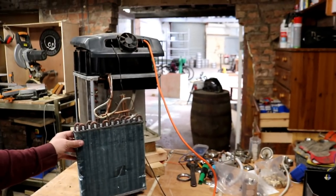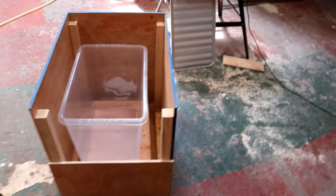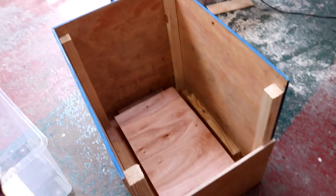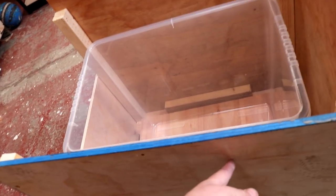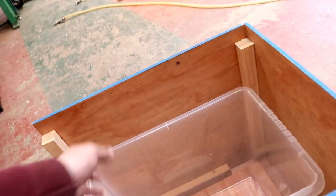This is looking exactly how we want it to look. You can see how we've got it on this base here, lifted up — it looks quite good. I've tidied the wiring up, replaced the electrics where needed, and we've got it working. Over here I've knocked together a plywood box with a plinth on the inside. The idea of the plinth is we can totally fill it up with expanding foam, get that sat in there — this will raise the glycol reservoir off the ground enough for us to insulate the bottom. We'll also insulate around the edges, let the foam cure, cut out a little section on the side for the pipework to drop in, and build some type of support on the side to hold the AC unit. Then we'll fill her up and give her a whirl.